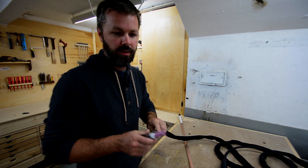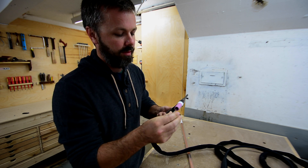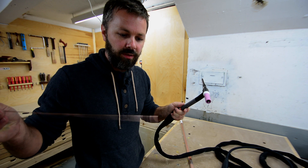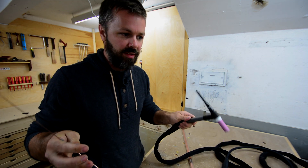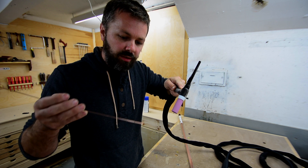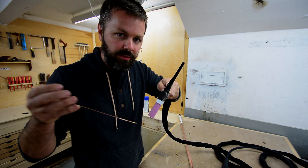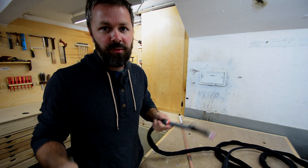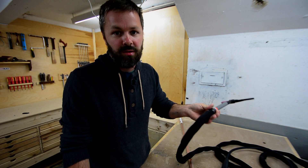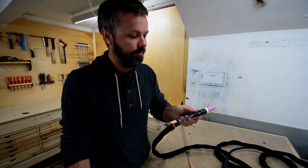You've got a torch and it's got an electrode in there, which I talked about at the beginning — tungsten. You just sharpen that to a nice point and lock it in. The idea is to heat up the metal with the torch, and then once it's hot enough, you just dab the filler in there. To get that stacked dimes look, all you've got to do is: get your metal hot enough, get your pool starting, dab it in, pull out, move forward, dab it in, pull out, move forward, dab it in. It sounds really simple, but it does take some practice. If you're spending an afternoon just on a piece of flat bar, you'll be surprised at how nice a weld you'll be able to get. It's a lot more difficult to get high strength, high penetration, but as far as making a pretty-looking weld, just a little bit of practice and you'll be there.